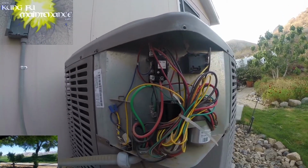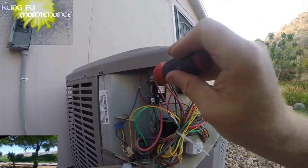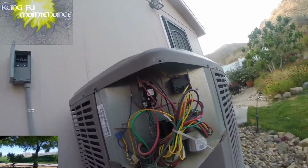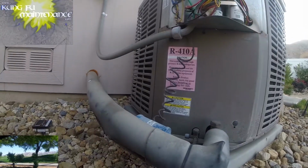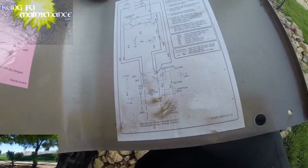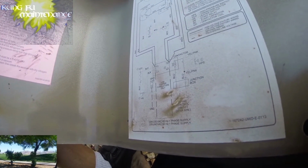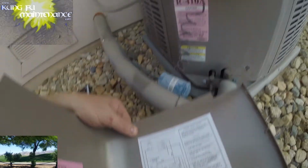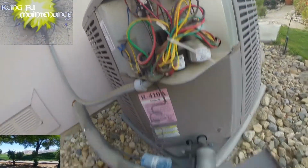Basically, the single pole contactor has one solid arm side where there's always constant power. One disadvantage there is that you've got constant power all the time on one side to different things, so it has a different danger component, in that there's constant power.